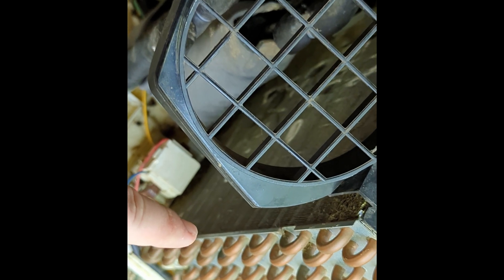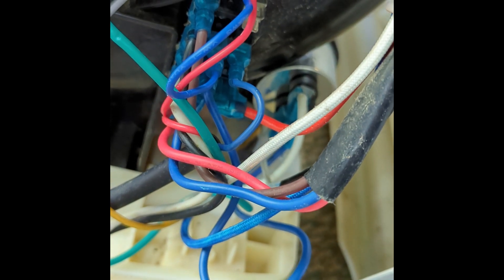So let's be careful when dealing with AC. This is the cool side — this is the evaporator. This is the condenser, and the condenser is what gets hot when the compressor kicks in. I'd call this thing a wrap and I'm going to get the cover back on and get it hooked up into the garage. What got this to work was re-adjusting some of the wires. I looked back at my pictures, and I had that bottom red wire kind of at the top terminal and it wasn't connected to anything. Once I moved that around, the capacitor kicked back in and it was able to get the compressor started. So we don't have a broken compressor. I was actually about to send it to an AC repairman, and I bought a second capacitor that's a slightly thicker diameter, so I do have a spare if this one dies.